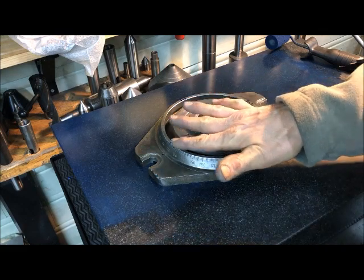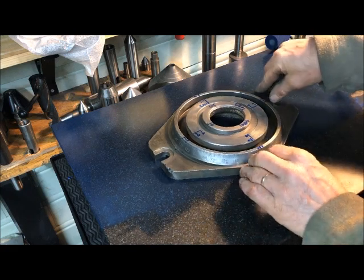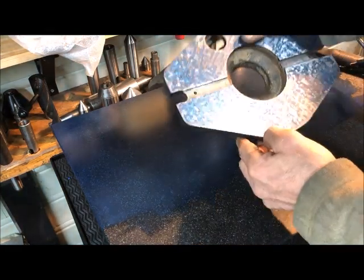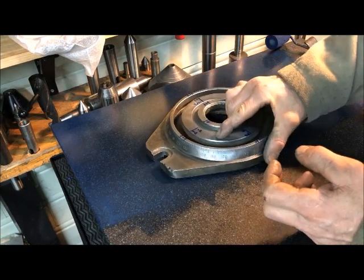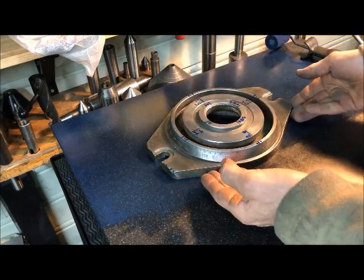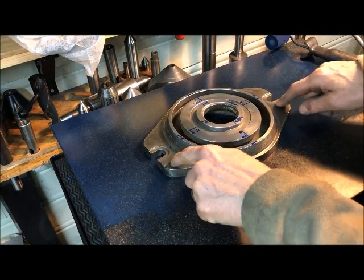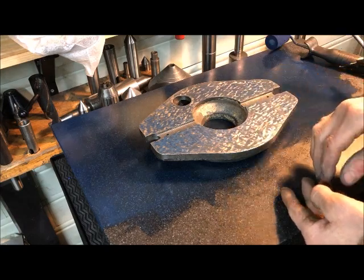Having established the amount of wear, I can scrape straight down to the plate here, and I think without any big difficulties keep it at the minimum on these surfaces. To verify that I have it in plane, I can invert it like that. The error — how much this is out of flatness with the base — will be magnified because this is much smaller, so I will be able to see it very clearly by measuring on the extremities. I think that should go okay.